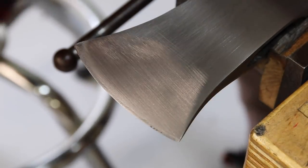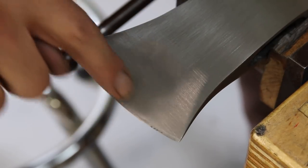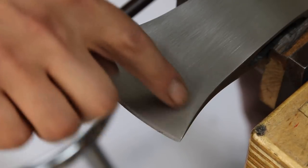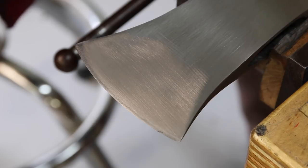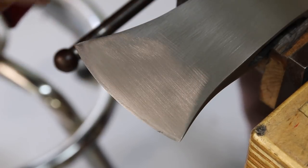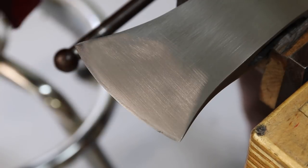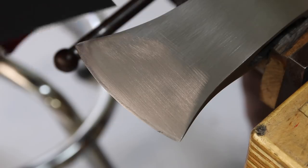On the other side of the axe, I've been spending over an hour sanding this side here and I've got some pitting that is so hard to make disappear. This section of the axe has been quenched, so the steel is much harder and it's much harder to sand. I've concentrated on sanding here for the last half hour and I can still see some pitting. It's got to go because once this axe is at a mirror polish these pits are going to stick out like a sore thumb. I'm going to put on new sandpaper so I can get maximum grinding and sand much quicker.